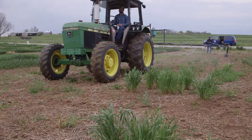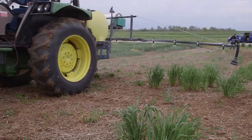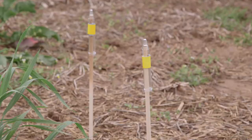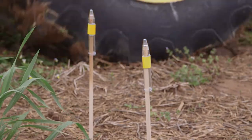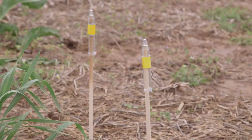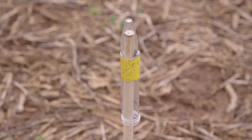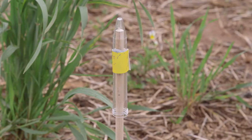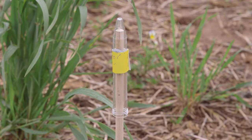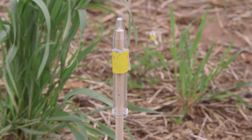How do we get coverage on the front and back side of that wheat head? We just put some nozzles on this and ran across here this morning. I'll send these around and let you look at them. When you've got blue spots, that's where the water hit — that's where stuff has hit the wheat head. So we've got some nice sparkly blue spots there, but turn it around on the back side and we don't have so many, which means we didn't get coverage on one side of that wheat head.